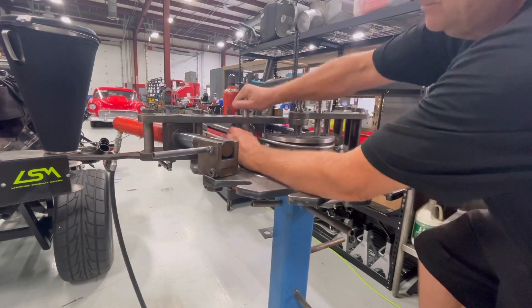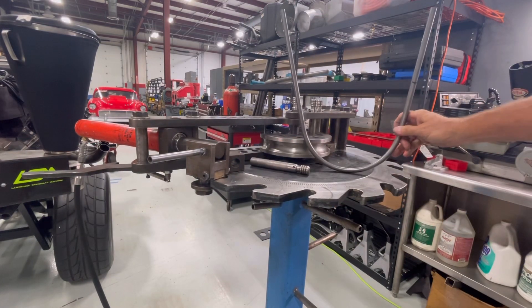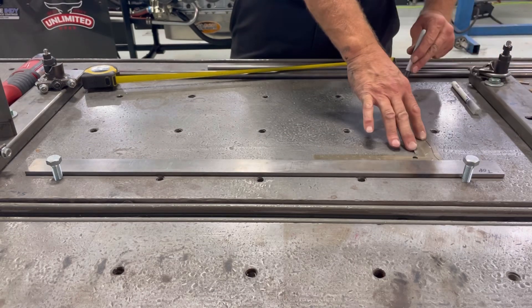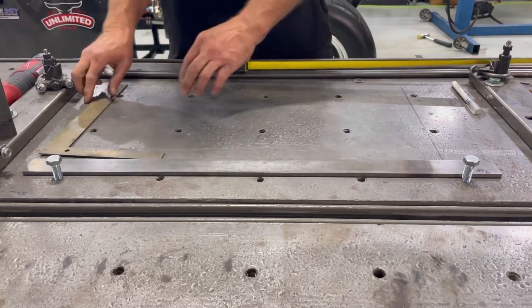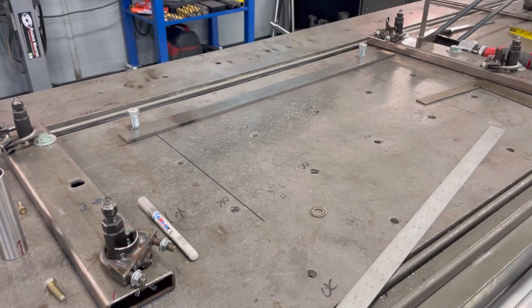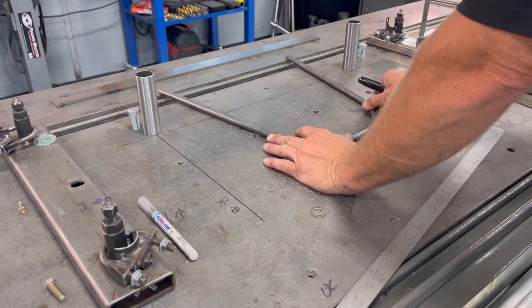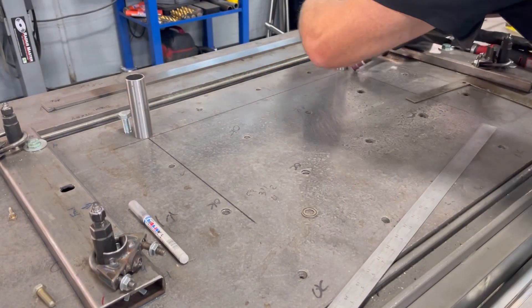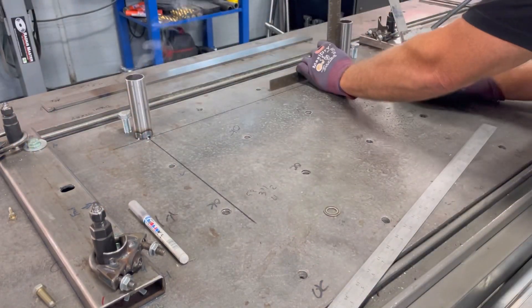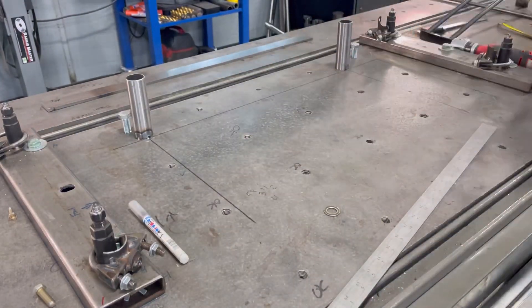The basic shape I'm trying to make is that the belt is 90 degrees on one side and on the other side it's slanted about 75 degrees on the side that has the idler, so I'm going to try and mimic that. On to the drawing board here. Last time you've seen this jig table, it had a two-seat dragster on it and I was throwing a front end on it, but they're pretty universal. Basically I'm going to make this thing simulate what the frame rails are on the nitro blender. I'm going to lay this out and tack these things down. When you tack something like that, it draws it one direction or another — I want to make sure these are 90 degrees to the surface so it represents the frame rails as best it can.